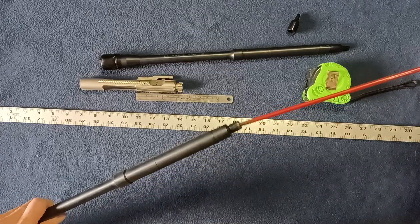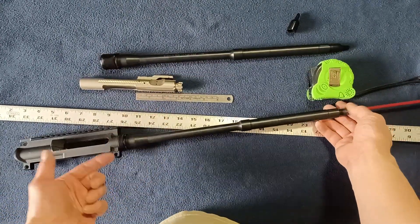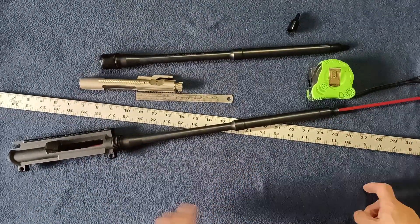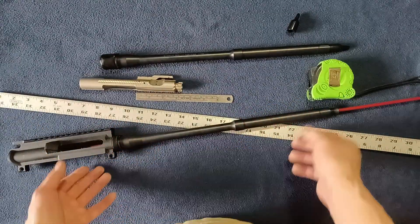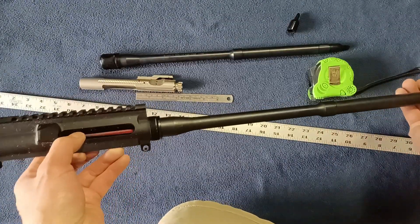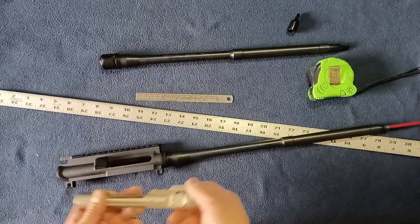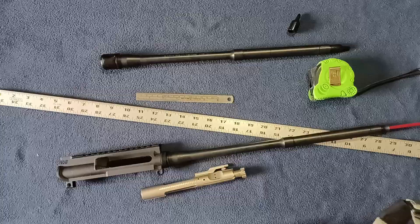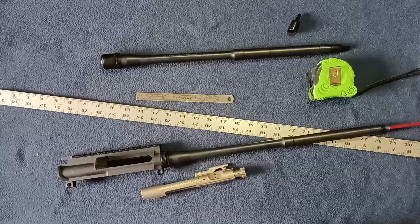That cleaning rod is going to be your reference point. You can use almost anything that fits down the bore — preferably something that will not damage the surface. Your barrel is very tough steel, so anything with a lesser hardness like brass, cardboard, or plastic won't damage it. You do need the bolt fixed in the chamber, otherwise the cleaning rod will have nothing to reference against. I should put a charging handle in there first to facilitate removing it afterward.